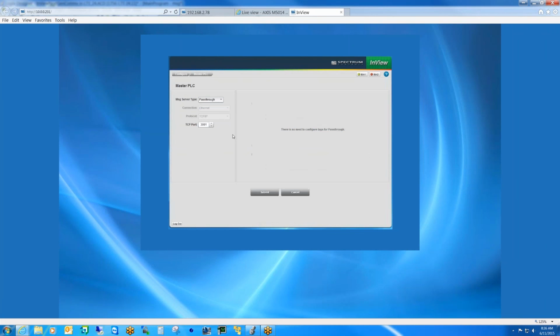Pass-through basically turns the box into an Ethernet to serial converter. So we have cases, especially with the old IMS software, where there was an ActiveX component, and a data API for that matter, that allowed the user to write messages directly to the sign using an application. So if they wanted to develop an application of their own rather than use a PLC, this is what you would do. Now with the old comms module, you actually had to buy a separate comms module to do that. So here we just added the functionality to the existing comms module.